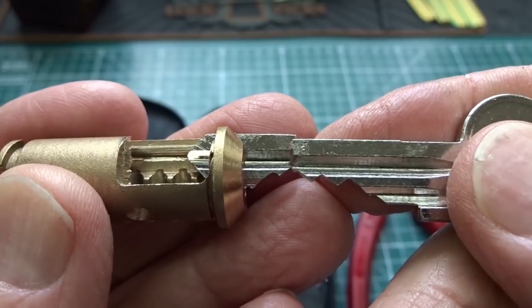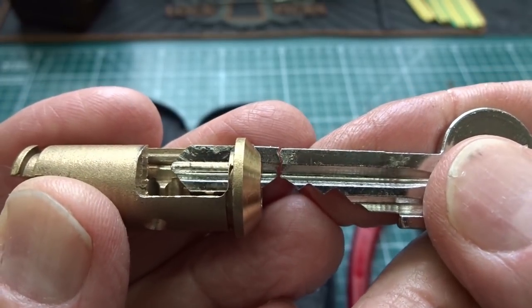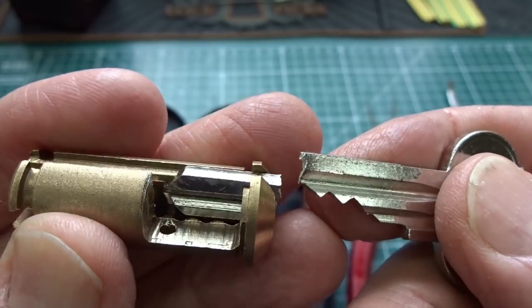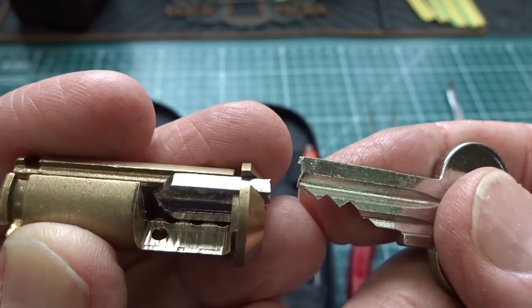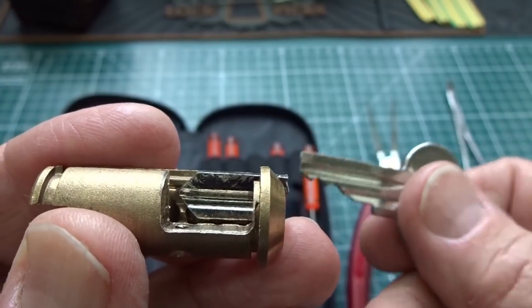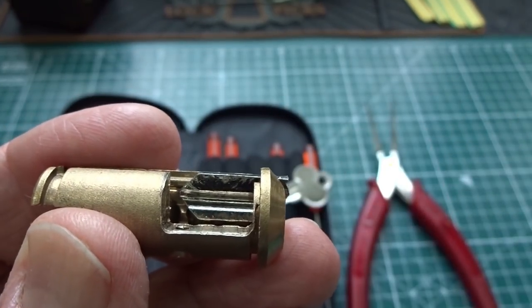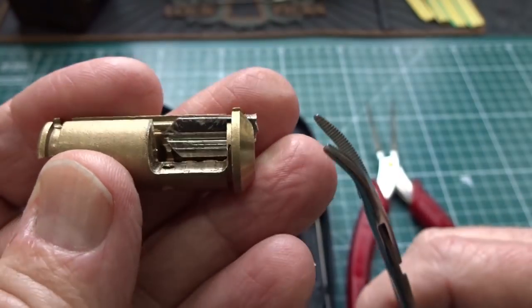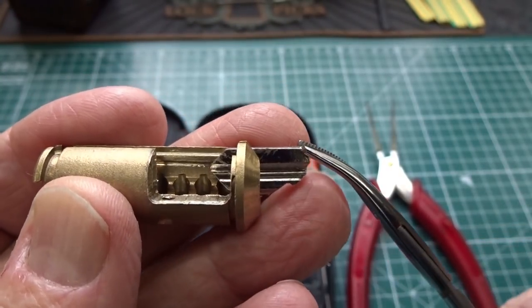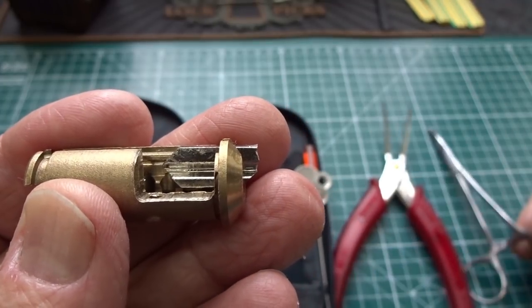So they're pushing into their door, they have a little sideways pressure, and as soon as it gets right there, the leverage snaps it off. Now, if they would just stop messing with it right there and say, I better call my locksmith, then you could show up with your forceps, and if I can do this through the camera, you can grab that with the forceps and you'd be able to extract it, but life's never that easy, is it?